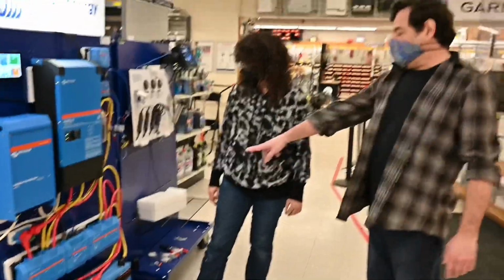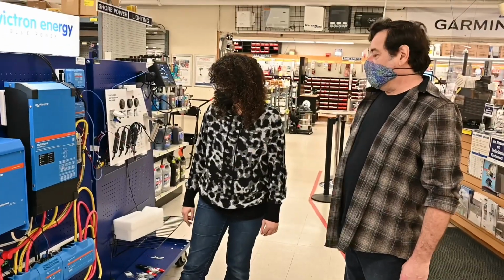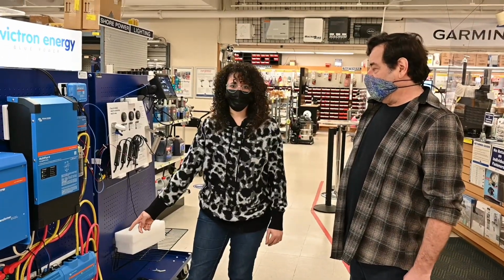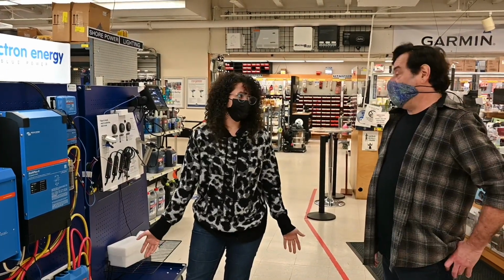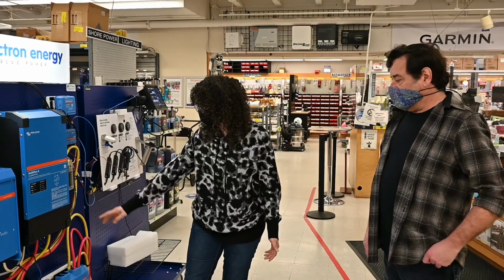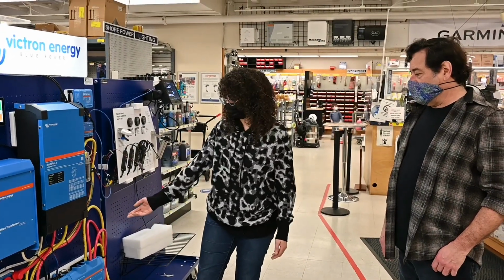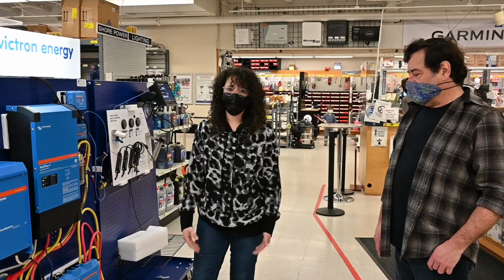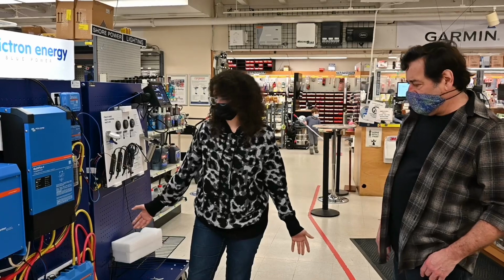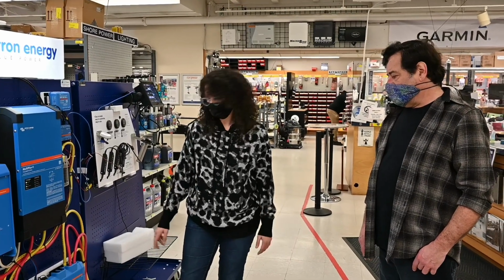So the distributor has nothing to do with how much power comes out of those wires, other than it's on or off. Yeah, and the fuse sizes, it'll blow if it goes to an amount of power that's not right for the wire size. We size it based on the wires because the wires are undersized for everything else, because we don't need to draw that much power. So we undersize the wires, and we base the fuses on the wire size because those are the weakest link.